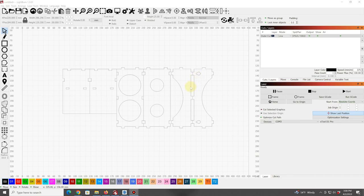On the back, these are spaced out for a pegboard-type wall so you can put this on some small hooks, hang it there, or put screws in the wall if you want it wall-mounted. I'm going to be cutting this out on the xTool D1 Pro 20 watt, set up for about 375 millimeters a minute at 100% power with air assist on. Let's send this to the laser.